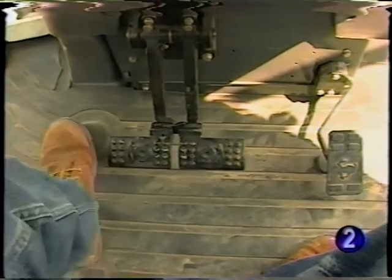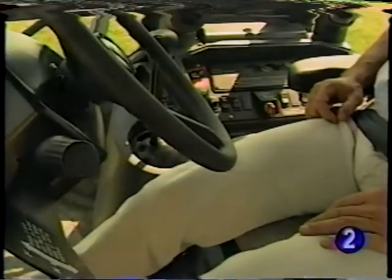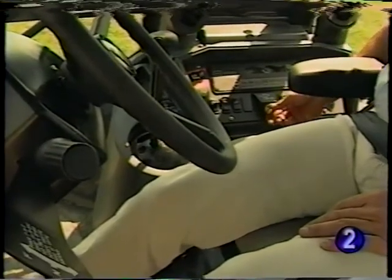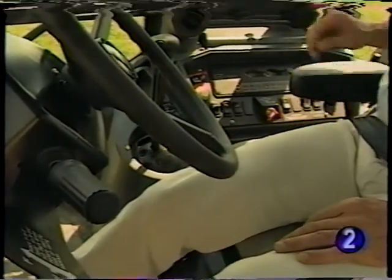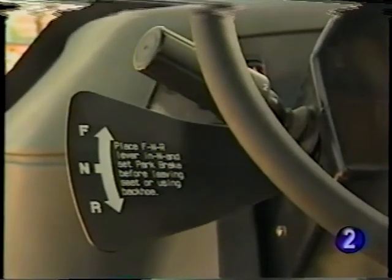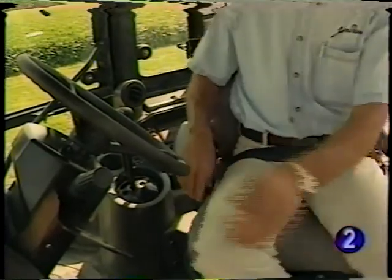The differential lock is used in poor tractive conditions — depressing the pedal engages the lock, releasing the pedal disengages it. Neutral start protection is another important piece of safety equipment designed into the G-Series: the unit will not start unless the direction lever is in neutral. Another point about the F&R lever: if it's left in forward or reverse and the operator moves the seat out of the forward position, an alarm will sound warning the operator to place the F&R lever into neutral before doing backhoe work.